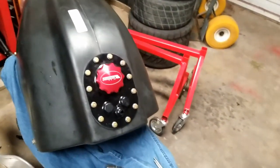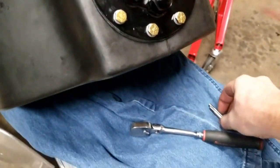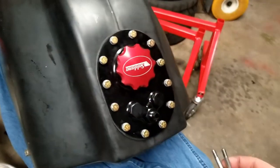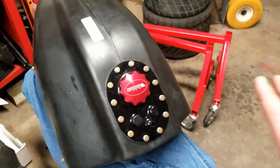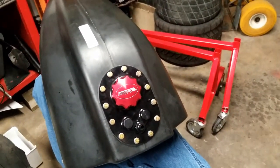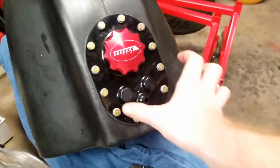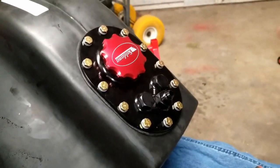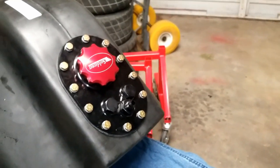Not gonna lie, that was a bit of a pain, but we got her on there. I learned a trick with these: when you stick the guides in, go across, and depending on how the bladder was shaped and sitting in there, it may be canted to one end. But once you get the two guides on, run all your bolts through your gasket, lay it on there, and then start your bolts on the opposite sides of your guides — it makes it a little bit easier. Now we're going to torque all these to 18 inch-pounds and we'll be set to go.